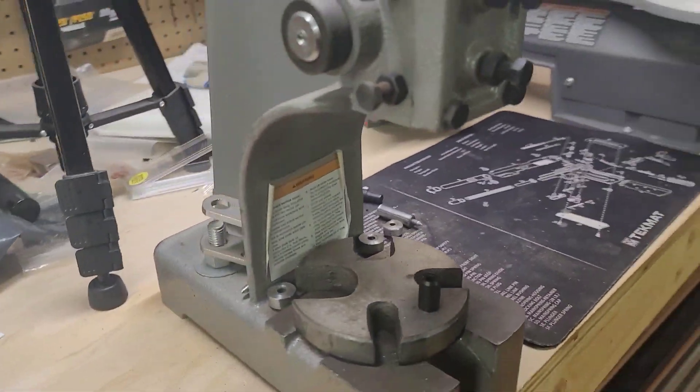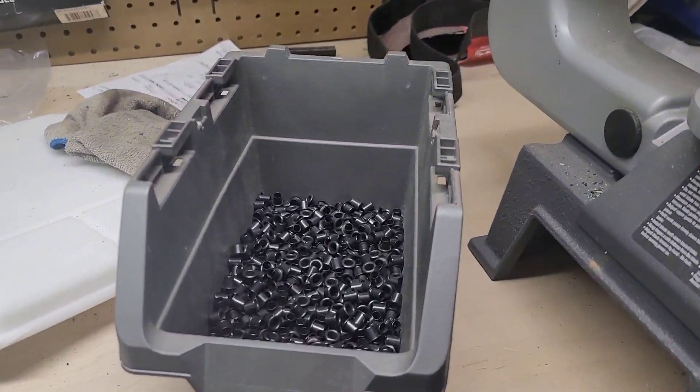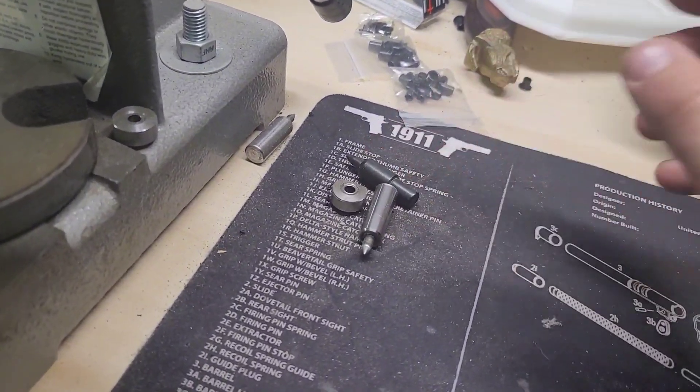Arbor press — you're going to need it. I got this one at Harbor Freight, I want to say it was $80. This is for setting the eyelets. It comes with a plate from Harbor Freight, but it does not have it drilled — you will need to drill it, but it's a good idea. These are the dies. DIYholster.com — I recommend this black one, it works awesome. The other ones are from holstersmith.com and they work great too. The black one is a smaller diameter, so it gets into smaller areas when you're vac forming — that's the only reason I have it. Otherwise I have all Knife Kits stuff.